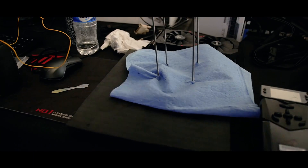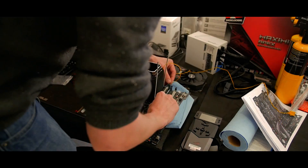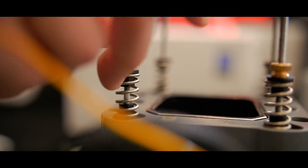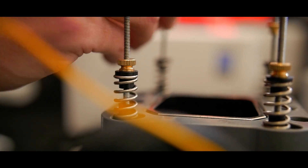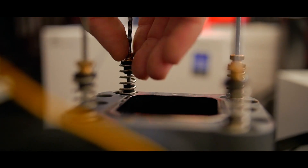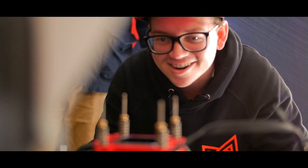After that, it was time to prepare the actual copper pots that go on top of the CPUs to contain the liquid nitrogen and drop the temps of these processors. These things were incredibly beefy, coming in at over 4 kilograms each. Getting an even spread of thermal paste on top of the CPU was necessary, then creating a good even seal with the mounting mechanism to make sure everything is tightened properly so the copper pot is dissipating all of the heat coming off the 7700K. The sheer mass of these pots allowed them to keep the CPUs at ambient temperatures even with no cooling in them.